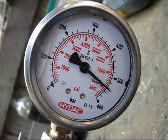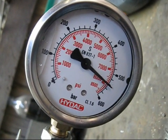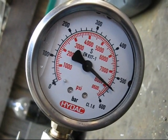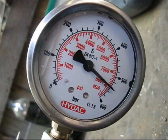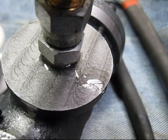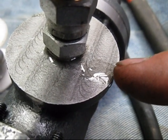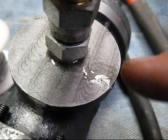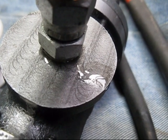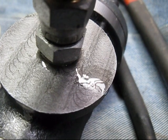Here is the gauge pressure — it is about 550 bar, which is about 8,000 PSI. I did get it to just a slightly higher pressure, but the grease pump doesn't seem to want to go much higher than that. I was wondering why the pressure gauge was dropping very slowly — just have a look just there, it's leaking out of the fitting that holds the pressure gauge in. Anyway, I haven't got any way of releasing the pressure, so I'll leave that overnight and in the morning it should have dropped almost to zero.